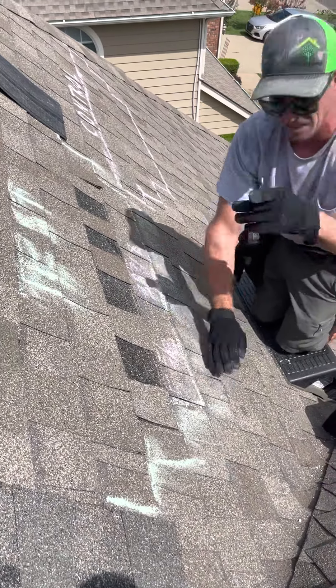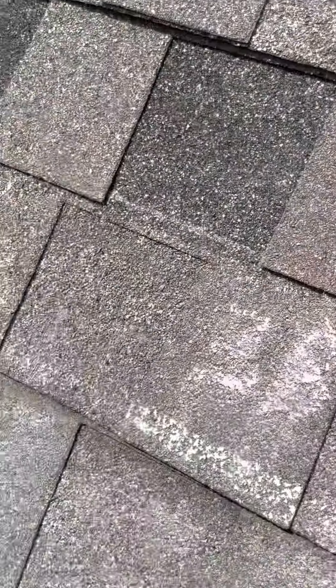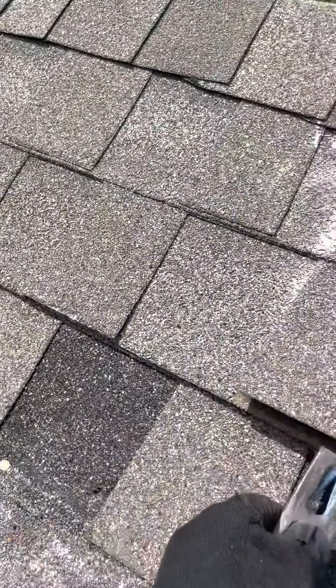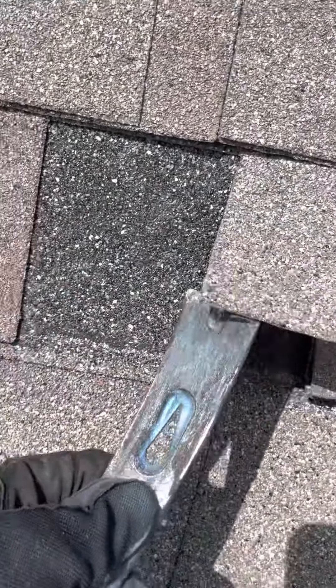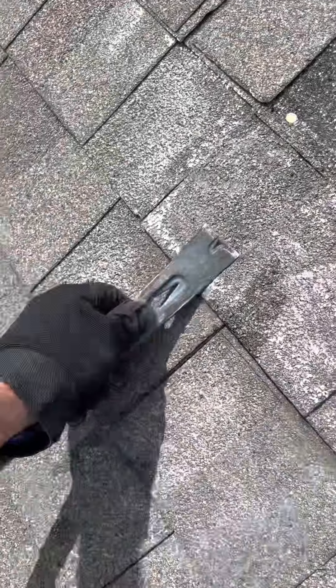All right, let's go ahead and look at this real quick — what we have going on here. You've got a crease on this one. If you look under here, you see all the mat transfer — mat transfer going on, stuck to the back of your shingle; just yet another shingle failure. Now remember in the beginning I checked the tabs — look what's going on with these now. You've got delamination on all of your tabs. These ones don't count, they're already delaminated. This one is the one we took out — see how it's still secure because we didn't have to bend it.